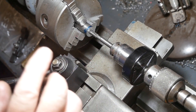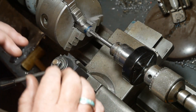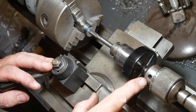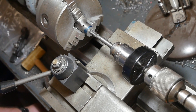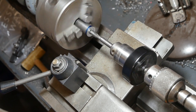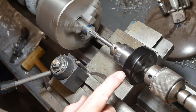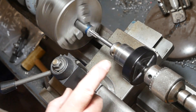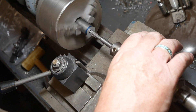So where we are: I've drilled the hole to 7mm — it's an M8 tap, so it should be a little bit less than 7mm, but it's for a demonstration. The D-Speeder is now in my drill chuck on my tailstock, which is not locked — it's loose. Now if you see what happens when I switch it on, I'll do everything at low speed. It turns with it, so you can see the tap is turning with the piece. All I need to do is hold on to this piece, and the minute I get resistance, I let go again — and that way the tap won't break. So here I go.